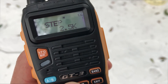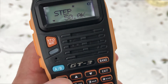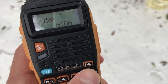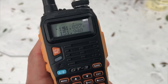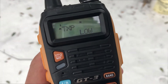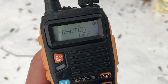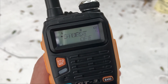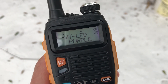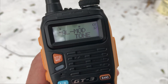If you're looking for more precision, go down to 2.5K. For larger frequency jumps, go to 5. That's how you change the step. You can see TXP is set to high because we changed it earlier — let's go back and change it to low. Now it's at 2 watts. Keep going through the menu and you'll find a lot of items, including the language setting and the LED color based on what you're doing.